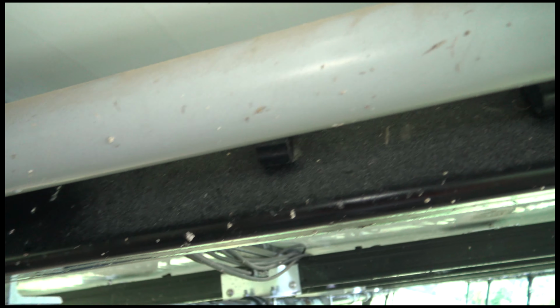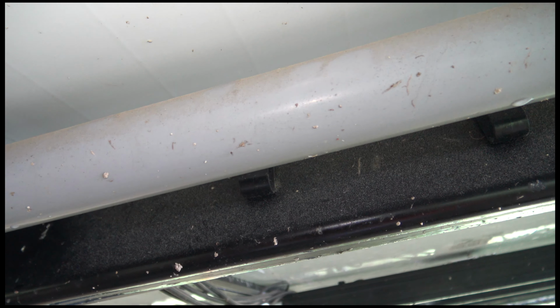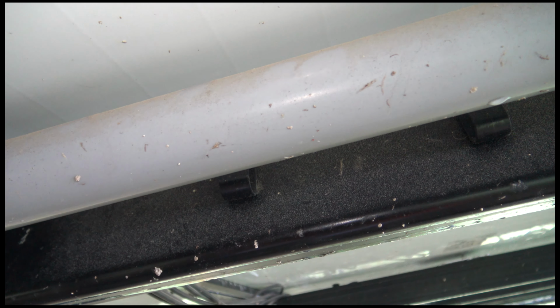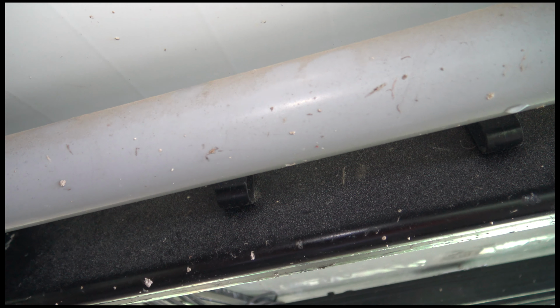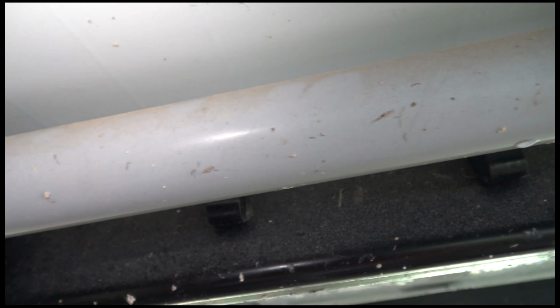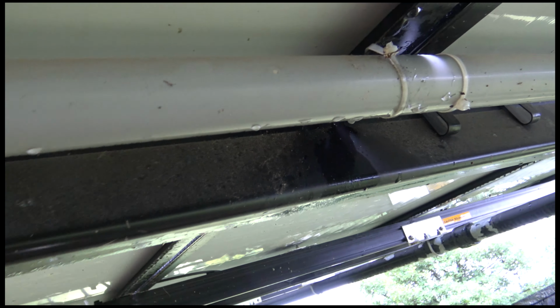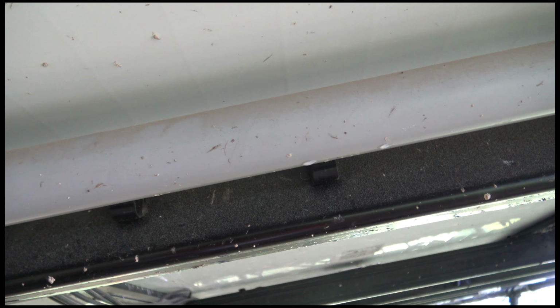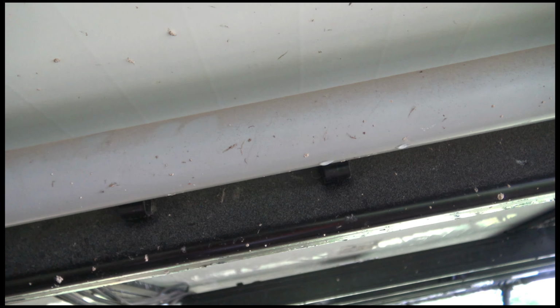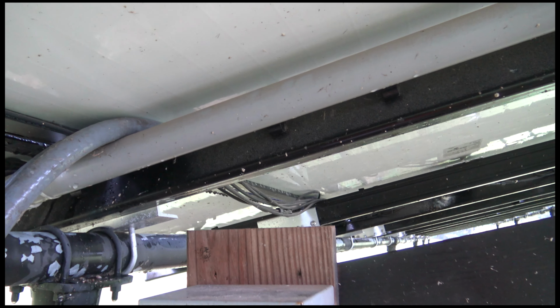But if, on the other hand, up inside this last run of 1¼ PVC, I had connected each of those aluminum cables to a 6-gauge THHN insulated copper wire using a mechanical splicing block with a heavy-duty heat shrink overlay, with each connection staggered about 10 inches apart so they would fit inside the pipe. That would pose a small problem because that wouldn't meet code, because mechanical connections need to be accessible, and inside this pipe they're clearly not. Nevertheless, I got the system to work.